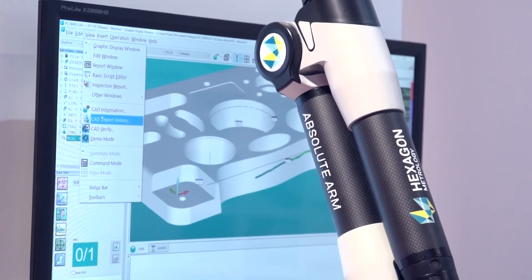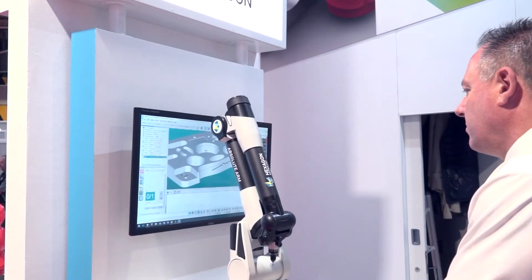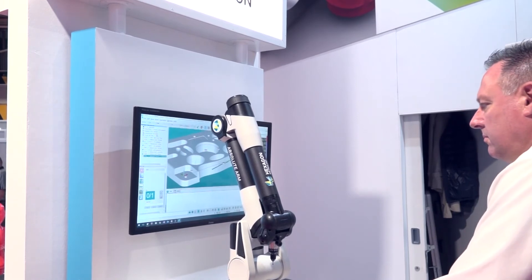An important point is that there are many 3D CAD systems on the market and lots of people create 3D product designs, but they don't always fully understand what's needed to manufacture a part. Within Visi, we have tools to make a feasibility study for things like undercut detection, parting lines, and part thickness. All of these allow tool designers to make sensible decisions before they start cutting steel, because making changes after that is a very expensive exercise.